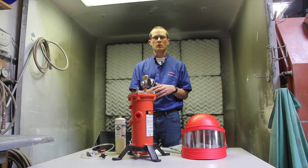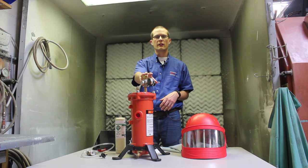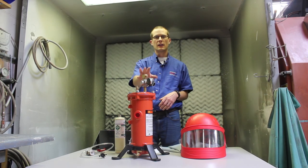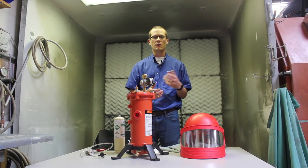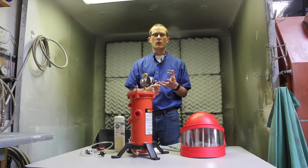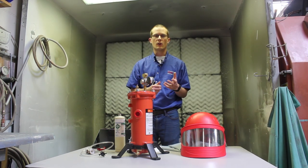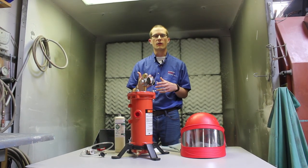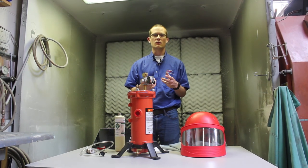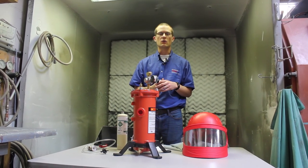One approach requires that you properly eliminate and monitor the air being supplied to your respirator compressor — that's applicable if you're using an oil-lubricated compressor. The other is to use a compressor that isn't dependent on oil for its functioning, so you can be sure it will not deliver harmful contaminants inside the breathing airline and won't expose you to carbon monoxide, assuming it's being used properly.